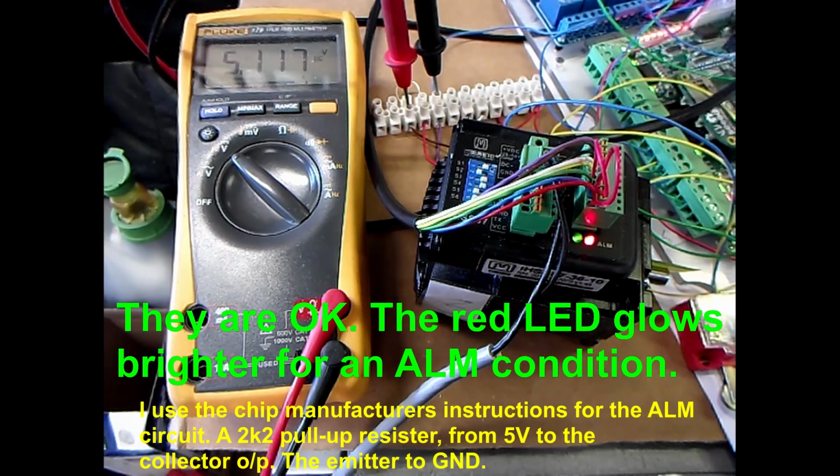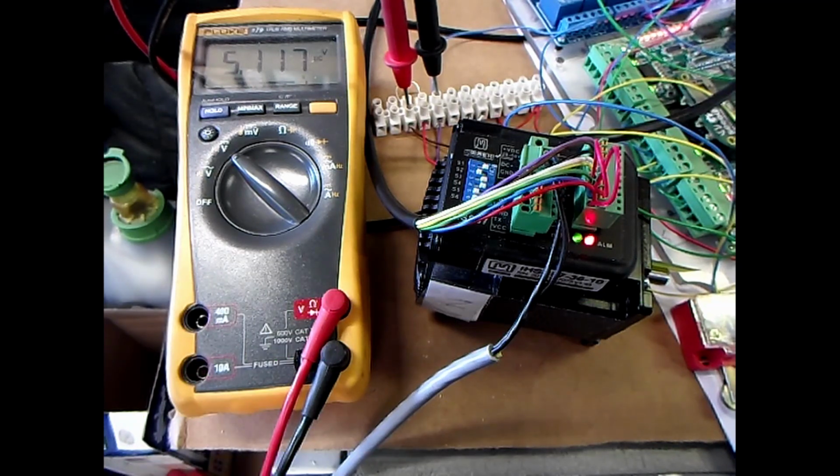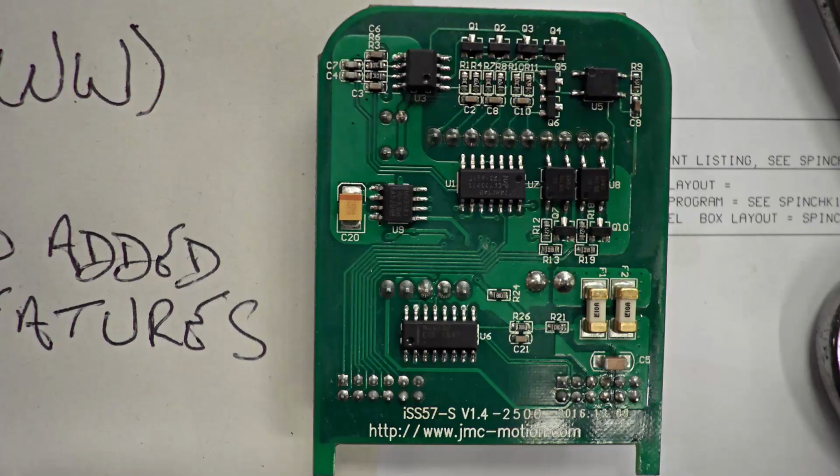Next line, M05, which means turn off the spindle. So this L-box has no power anymore. It's been on for, could be 20 milliseconds, it could be 50 milliseconds, it could be 100 milliseconds. But it hasn't been on for very long. The power supply would have charged up by however much it charged up by. Next line, G00Z20, so rapid to Z20.